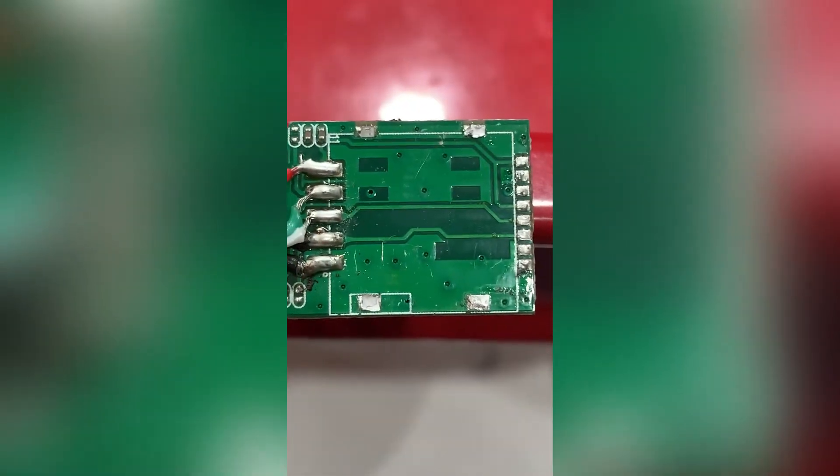I bought a new one exactly the same. I'm going to get some soldering wick, take the wick and clean out the pads — one, two, three, four — clean those tips, then add new solder and solder the new one in. Hopefully I didn't damage anything. There's like a scratch right there; any break on those traces usually causes an issue, but it doesn't look severe.